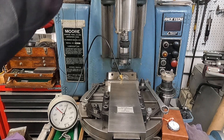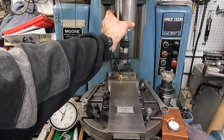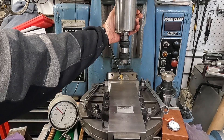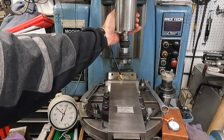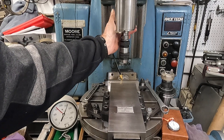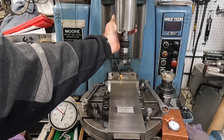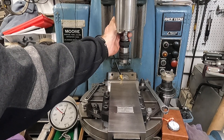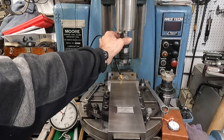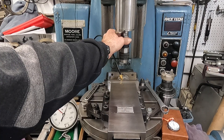On the later machines — the number three — they put a thermometer on here so you can monitor how hot these bearings get. When these bearings are brand new, you can run this at full speed for 20 minutes and it's still cool. I put these new bearings in 20 to 25 years ago and they just barely get warm now — I notice a slight degradation of surface finish, slight but still great. Be aware that spindle bearings are an expendable item.